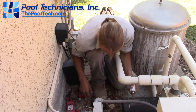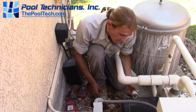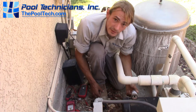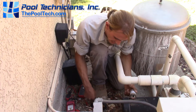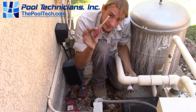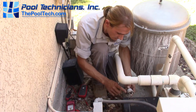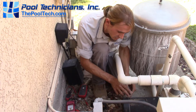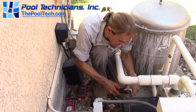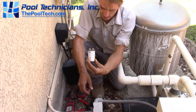When you pull this capacitor out, make sure the circuit breaker is turned off. In this case we have the time clock turned off, but to be safe it's always good to turn the breaker off before you discharge the capacitor. To discharge it before you touch the wires, take any tool with an insulated handle and tap across those two terminals. These do store a charge, so if you touch them with your bare fingers before you discharge it you might get a little zap. Now that it's discharged, pull these leads off — we have our 30 microfarad start capacitor.